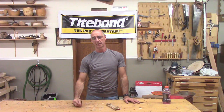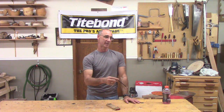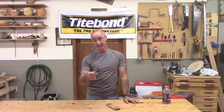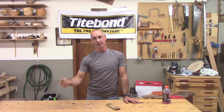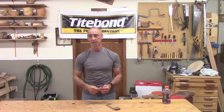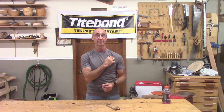Titebond 1, Titebond 2, Titebond 3, I don't base my choice on holding power. I base it on where the thing is going to live when it's done. If it's an indoor project, I'm using Titebond 1. If it's an outdoor project, it's either 2 or 3. 2, if it's going to get damp, like an Adirondack chair. 3, if it's going to be wet, like a flower box where there's constantly moisture inside it. But from a strength of joint perspective, they're going to be interchangeable, I think.